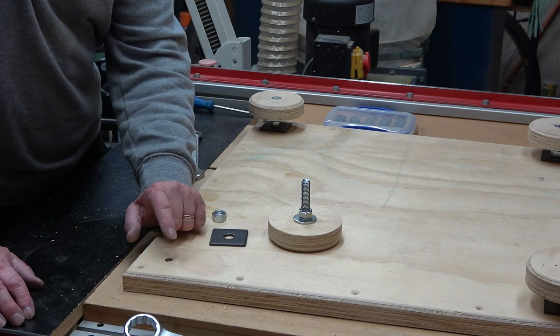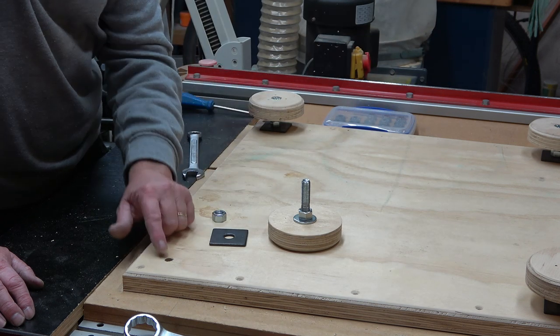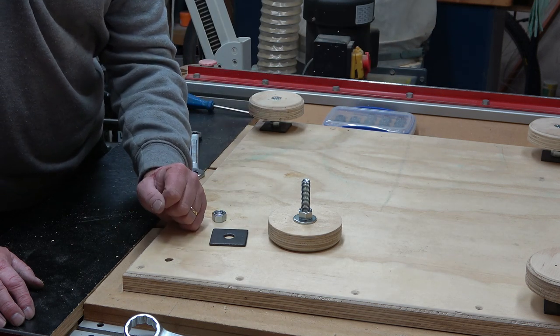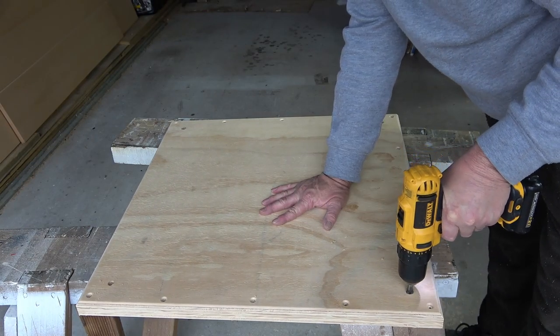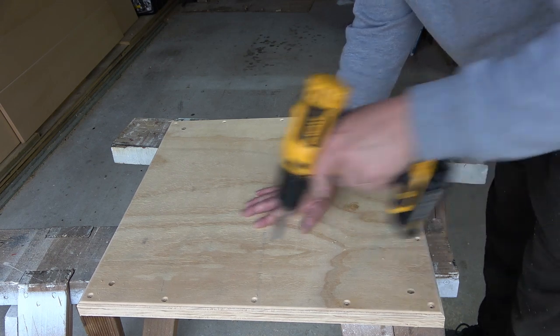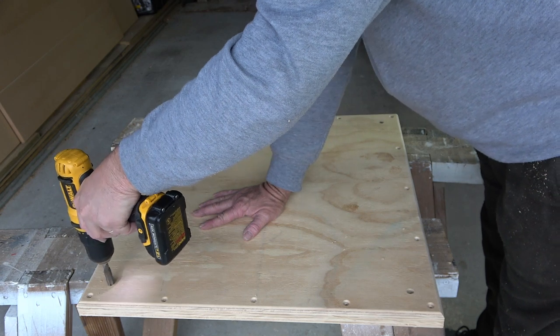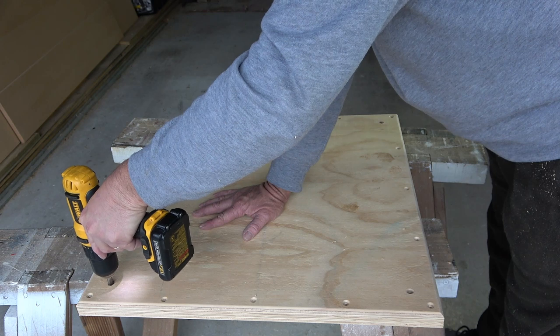Now, when I originally made these here, I put four 10mm holes, one in each corner. And then I ran a tap down them. To thread these holes, I'm using a 12mm metal tap. Now, if you're concerned about the threads breaking out — there is no weight on these threads. They're only used to hold the feet in place when you lift the chair up off the ground.